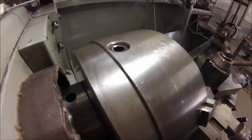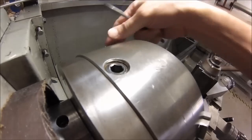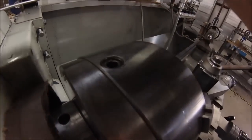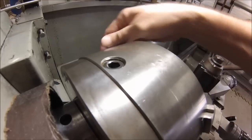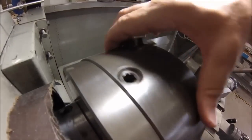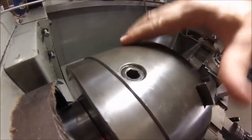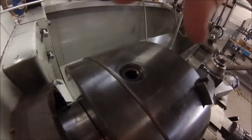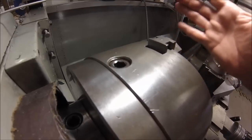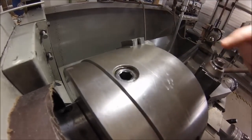I may have made an assumption that you actually knew what your adjustment screws were on your chuck. I'm going to cover that quickly. On this particular chuck, there's one every 90 degrees on the outside. When you tighten these down, the whole body of the chuck lifts up — it can only lift if the screw on the other side is backed out. By tightening it you're lifting the part; loosening it just means it has the potential to move if the screw on the other side is tightened. It's always a good idea to leave slight pressure on these so that as the machine vibrates and pressure loads up, the chuck doesn't move. After you're done indicating, make sure each screw is snug and then check your indication one more time.